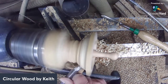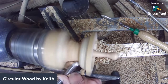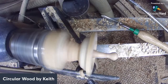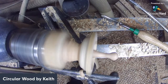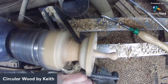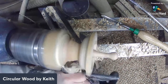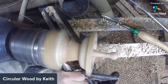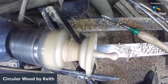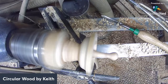The piece that Douglas was talking about, the piece of yew, is a piece of trunk yew, hence the size, of course. So depending where up the trunk it's come from, the higher up it's come, the longer it will take to dry. In theory they talk about a year per inch of thickness plus a year, so you can be looking at 9 years for that. Yeah, it just takes a particularly long time for yew, because it's a slower growing one. Quite dense timber, isn't it?